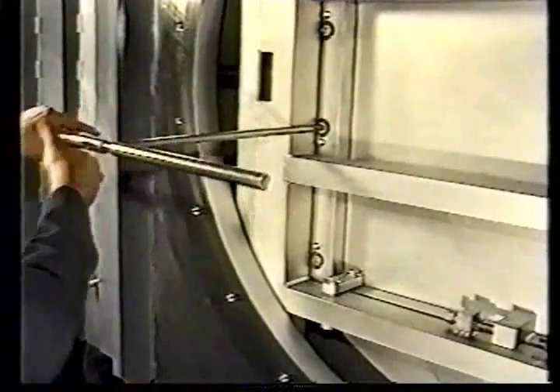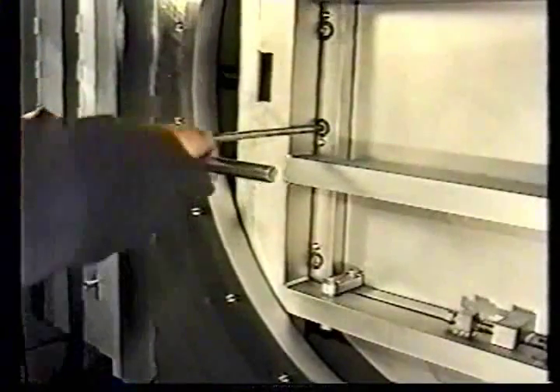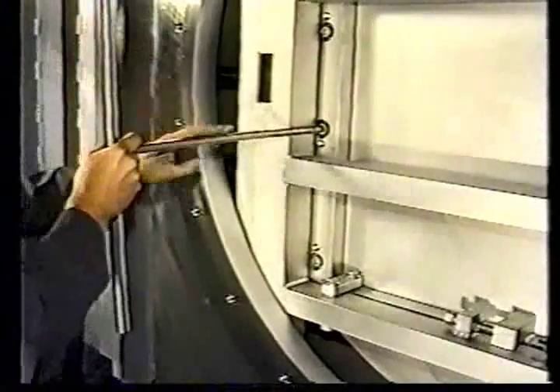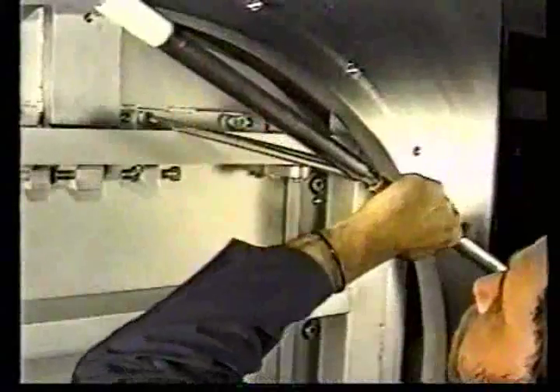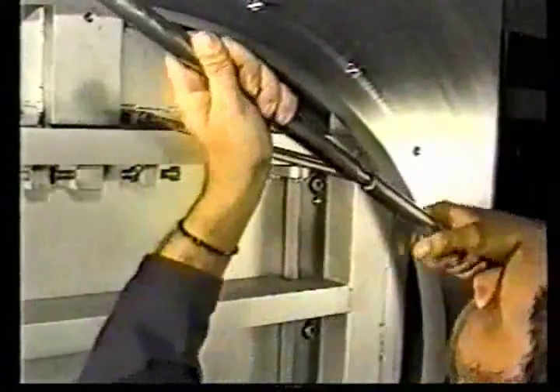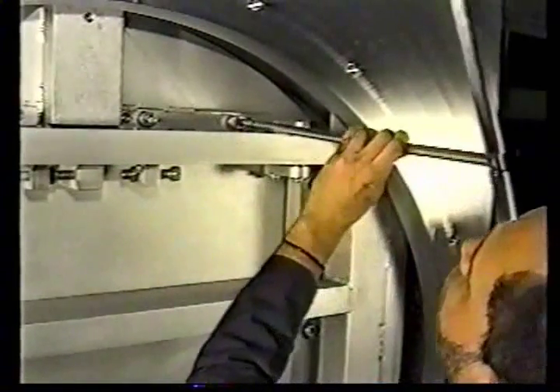In sequence, begin to tighten the tightening bolts. Prior to applying the final torque on the tightening bolts, you may check the uniformity of the gate adjustment by measuring the gap between the gate plate face and the body flange with a feeler gauge. Measurements should be taken around the circumference of the gate plate and recorded. This will give the maintenance technician a basis for further adjustment if required. An acceptable deviation in the measurements for a valve of 36 inches to 52 inches is 10 thousandths of an inch to 15 thousandths of an inch.